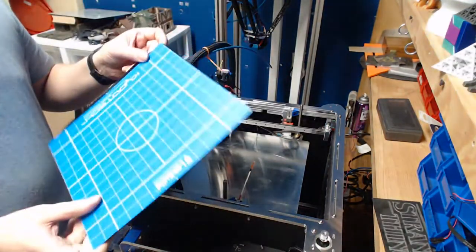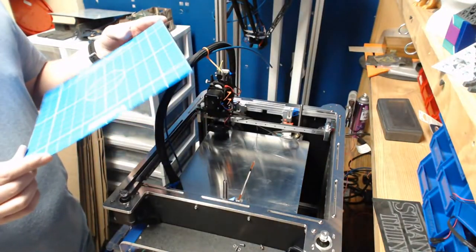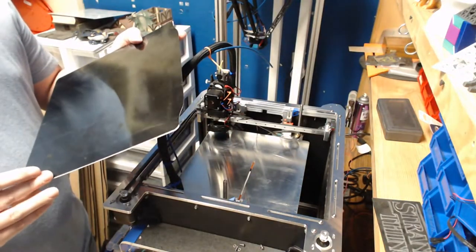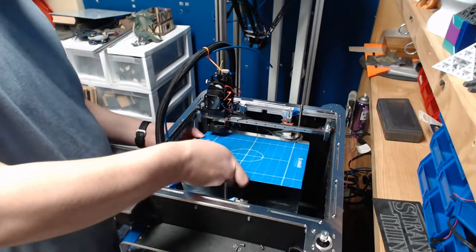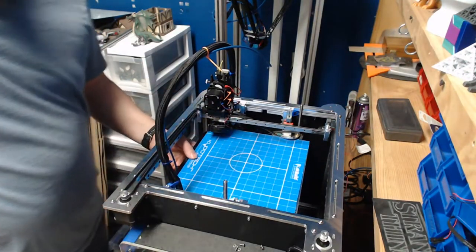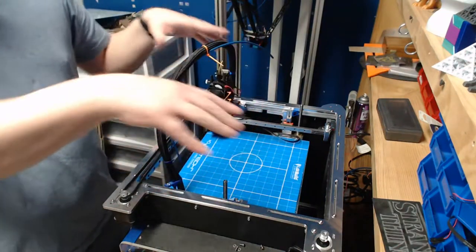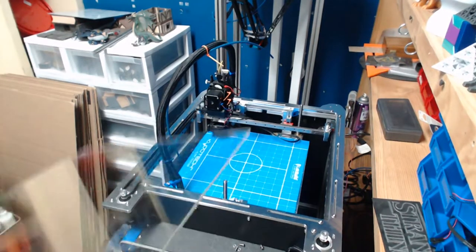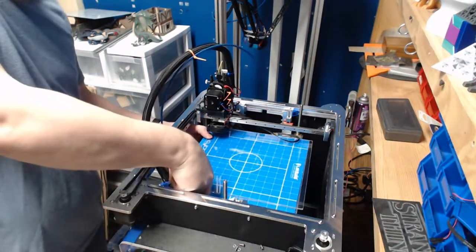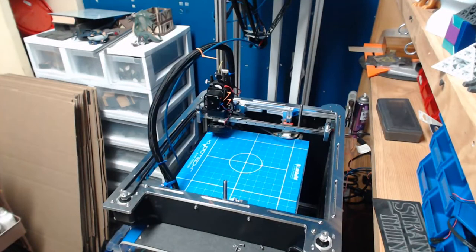And then this one is from 713 Maker. He cut it and he's debating if he's going to do these or not. He's still trying to decide if it's worth it for him to make the flex plates, or if it's easier for people to just grab them from some place like Gecko Tech. There's a couple others that sell custom size spring steel flex plates. But the bed is the RailCore ZL aluminum bed with the slots for mounting and everything, with the magnets built right in. And since you mentioned glass, you can, if I don't shatter it here, you can drop Boro right on top too. So I have the option to do glass on top of mine as well. It's fun to be able to play with different surfaces, but it's not flexible glass, it's just glass.